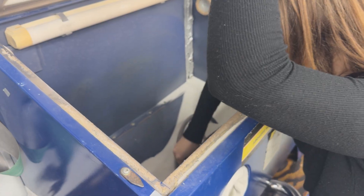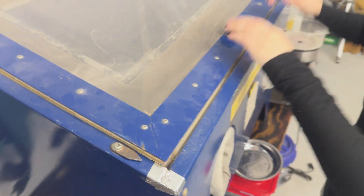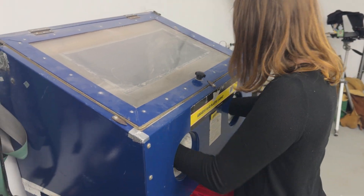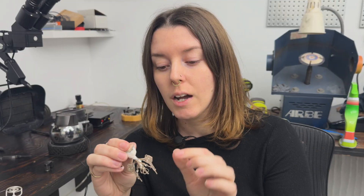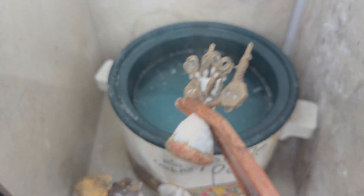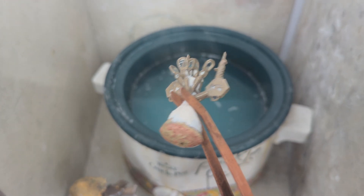Okay, so we went through and quickly cleaned this up. Now that we get a chance to actually look at the surface of the bronze, we can see that there are some surface issues — we didn't get a full and complete burnout on the bigger items. This is common knowledge: the bigger your item is, the longer your burnout generally should be.